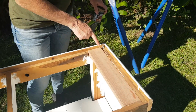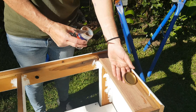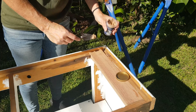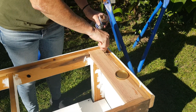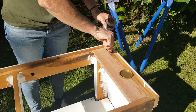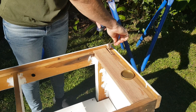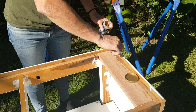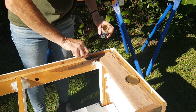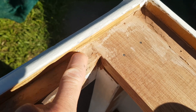Now that we've got that piece in there's far less for us to have to patch up. I'm just going to use some of this — it's a wood blend, just for patching wood, something I had left over. It doesn't really matter what color it is because we're not going to see it anyway. It says to only apply it in depths of 10 mil, which is one centimeter, so I'm not going to fill it right up now — I'm going to get some in there, let it dry, then come back in two hours and fill up a bit more.